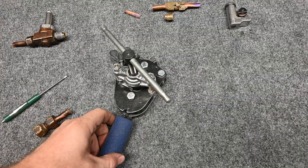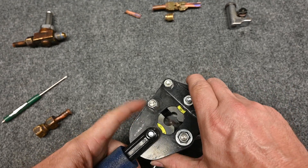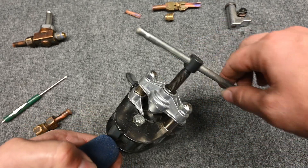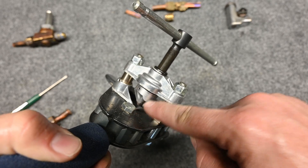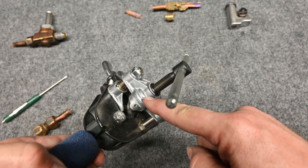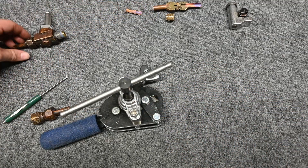That model has come a long way. In a flaring block like this one, it has all the pieces together. I pick what size copper I'm working with — 3/8ths here, and I make this side 3/8ths. As I pull this piece in, it latches, and then I tighten this up. Notice these have little ridges, which allow a smoother, rounder, better quality flare than just a straight cone shape. This one also has a nice feature — a clutch inside that prevents me from over-tightening the copper. As I'm tightening, if it gets too much pressure, it starts to slip so that I don't mess up the flare or make the copper too thin.